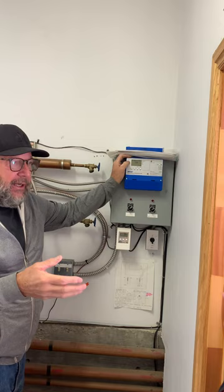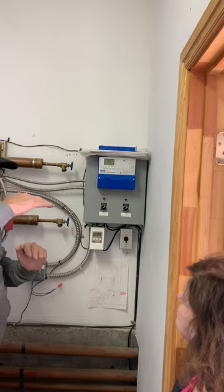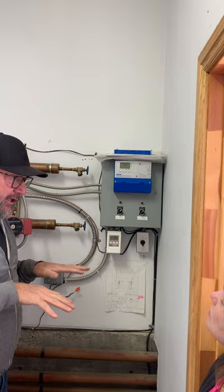I tell people, you've got to preheat the oven. And in some cases, you have a damn big oven to preheat. But you might spend the first couple of 3 hours bringing the driveway from sometimes below zero up to 33 degrees to even get started. But we're only aiming to bring the driveway to, we'll check it, 38, 40, 41. You don't want a 50, 60, 70 degree driveway at the end of the melt cycle. It's just wasted BTUs.